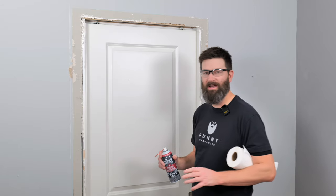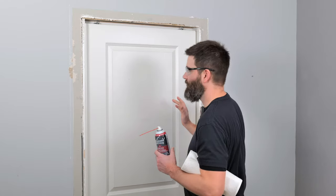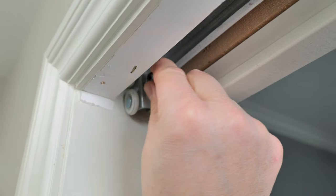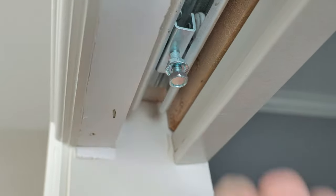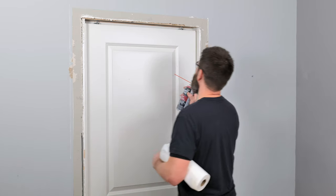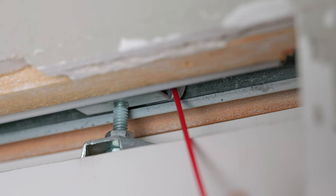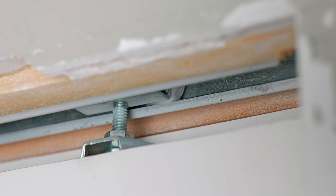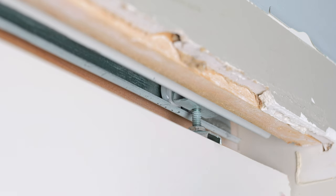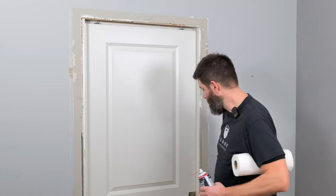The secret is to shoot this in exactly the right spot, otherwise you'll make a huge mess. I have this side of the pocket door ripped apart so we can see what we need to do. This door has two rollers, each with four wheels. You can only hit the far-side wheels from this side. Get right into where the wheel and the bracket meet and give it one foamy shot — it's going to create a little foam ball around the wheel. That covers the four wheels from this side.